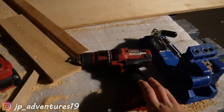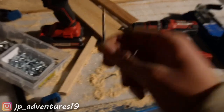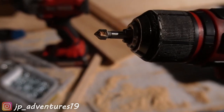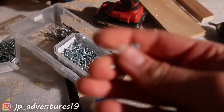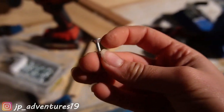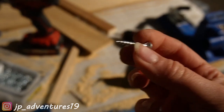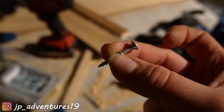Those three screws are in. It's a bit annoying because I have one drill and one impact driver and only one tiny battery — the others are charging and Patrick's using the grinder, so he has one of the batteries too. So I drill the hole, swap the bit, countersink it, then use the impact driver to put the screw in. These are countersunk head screws — make sure you countersink first because otherwise the heads can snap off way easier. Like this, they really sink in there and then you can put wood filler on top, sand it, paint it, and they just disappear.